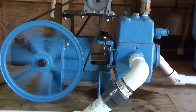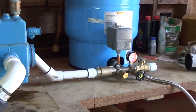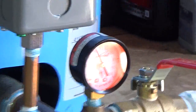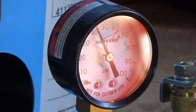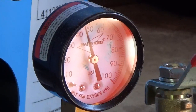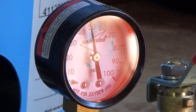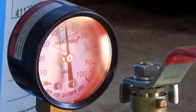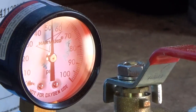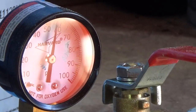That's the old school piston pump running. We're taking that rainwater and boosting it up. I'm bypassing the pressure switch right now, and I don't have any solar hooked to this — just two car batteries just to test it out and prove that she's making pressure. That pressure switch should click here shortly — there she goes, she just clicked.